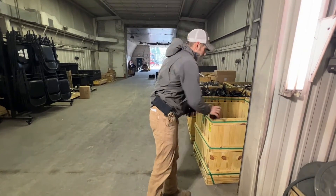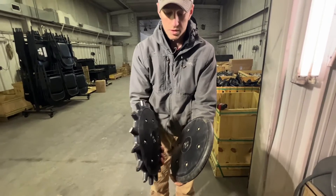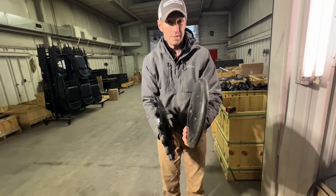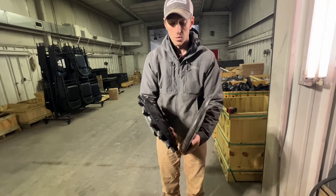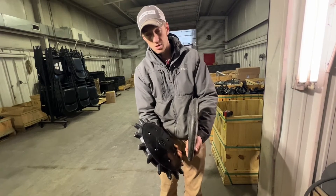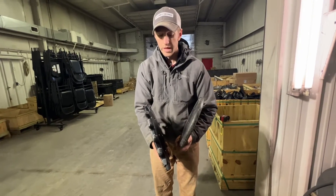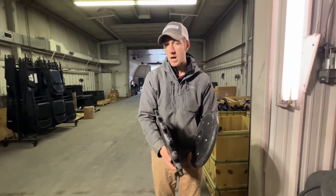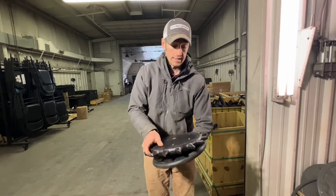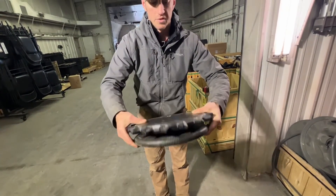What I'm getting at is we're going to have two different diameter wheels going through the ground, which means this wheel is going to be carrying 90 percent of the weight of that tailpiece, and this wheel won't even be touching the ground because we're running two different diameter wheels. A lot of times that can pitch your tailpiece, or it will simply carry the smooth wheel. So one big reason why we don't advocate running one spike per wheel is because of the different diameter wheels — and you can see that right here, they are different diameters.